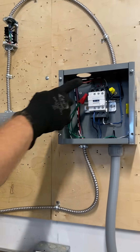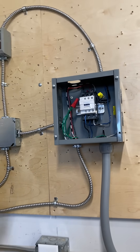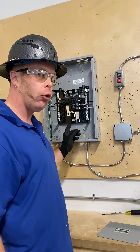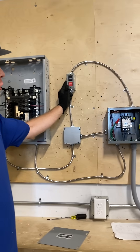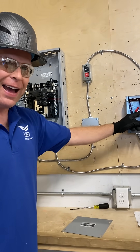Mind you, I apologize for these not being connected, but we are troubleshooting right now. The main important thing is when you're running three-phase, make sure that you have a neutral connecting in with your service line to be able to control your contactor.